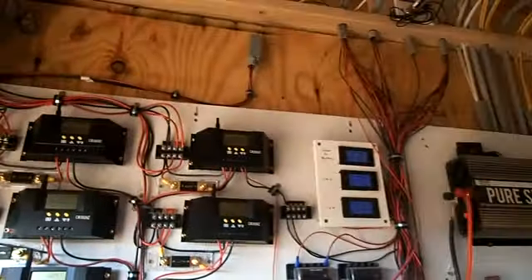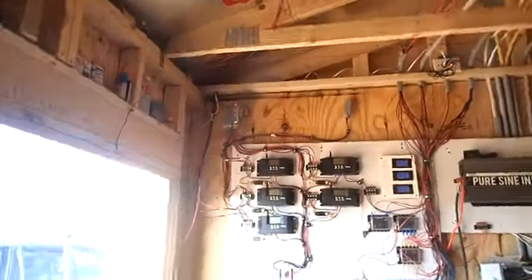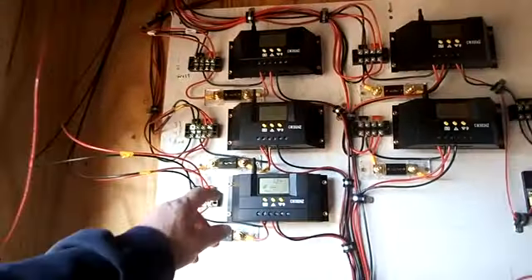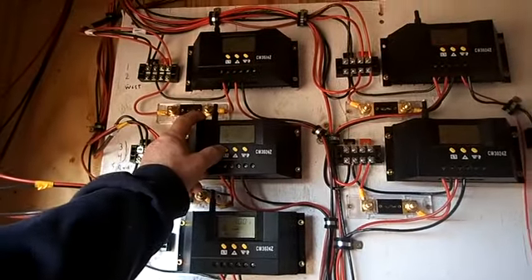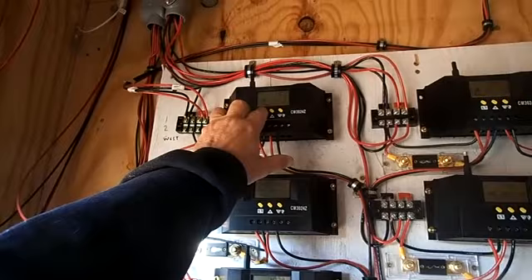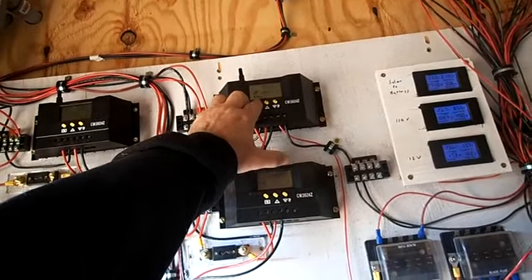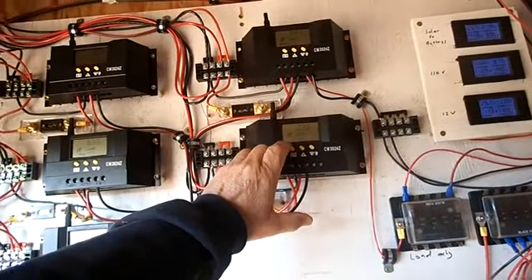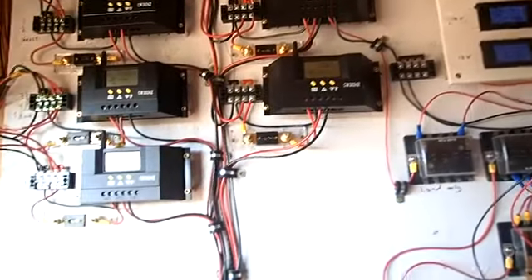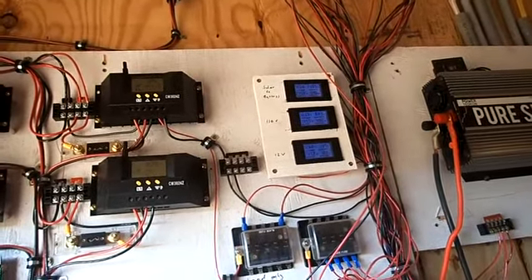It's the third day on solar panels. Yesterday was too windy to do anything, so we went to town and bought stuff we probably didn't need. Right now we're charging — it's about 8:33 AM and we're charging at 20 amps already. The east is at 9.5. The first three upstairs is at 6.46. The west is at 0. The next three are at 3.41. And the single by itself is only at 0.32. So we're at 21.68 amps, using 8 amps on AC and 1.37 on DC.